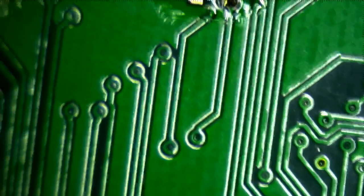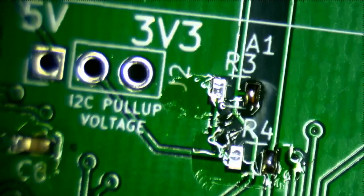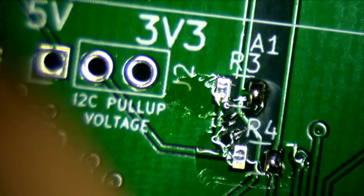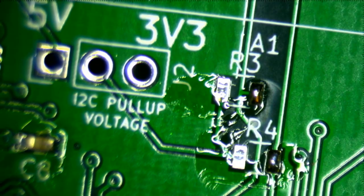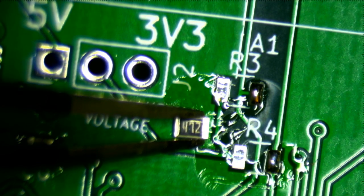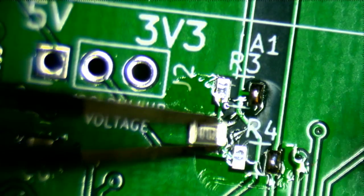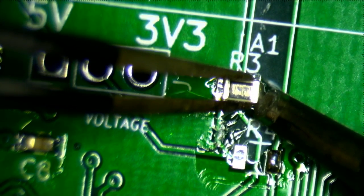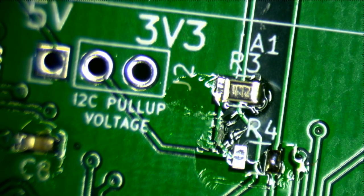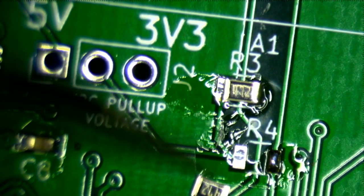Okay. These resistors now. Oh, is cleaning really necessary? Yeah, because flux does actually have an electrical effect, especially if you're dealing with fast speeds or sharp signal edges. It will act like a parasitic component. So you really do want to clean the flux off. For the most part, with most things, it's not really going to matter, but I would just clean it off, as a matter of course. Just do it.